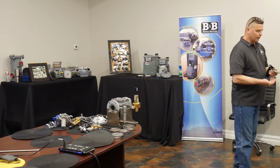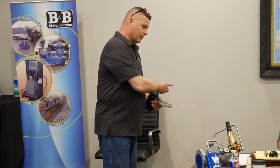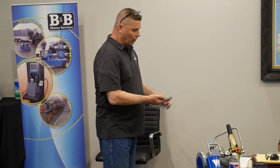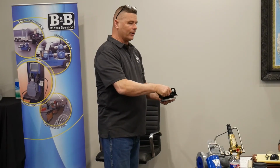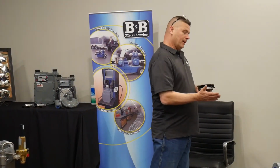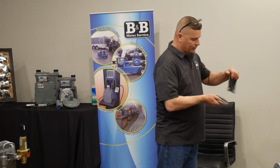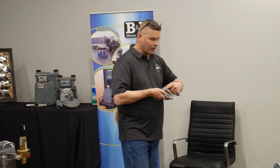I told you that the gas comes up through here and then basically goes to the other side to pass through. And it's our control over how much gas we're allowing to cross to the downstream side that is involved in that regulator's ability to have that rangeability, to throttle the gas and to shut off what it's supposed to shut off. Since the control point is the downstream edge of this throttle plate, that's where it's crossing. That's where the wear occurs.